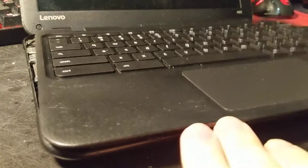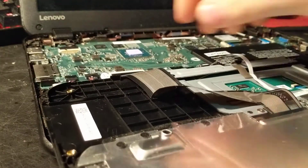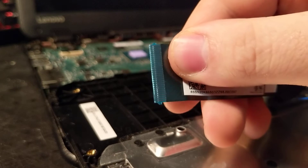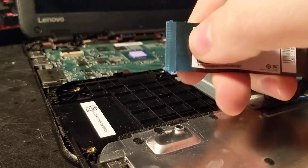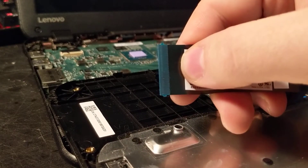I found after tinkering with it that if you turn it over and take the ribbon off the board, the issue — if I can get it to focus — is these little pads on the bottom of the ribbon. You can see the little white line closer to the edge right there. Apparently they actually wear down and corrode, and it breaks the connection.